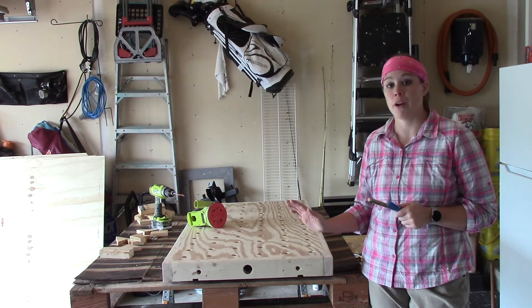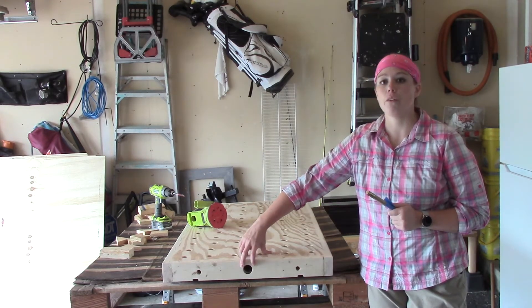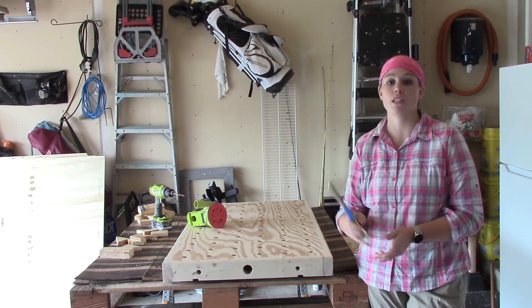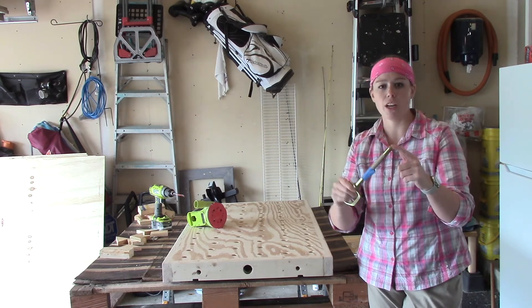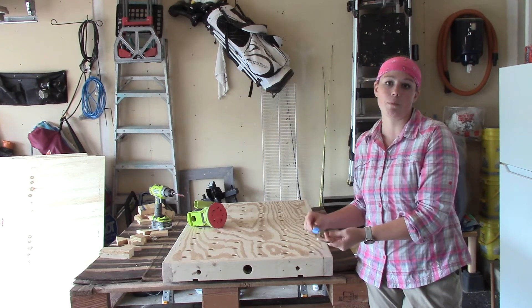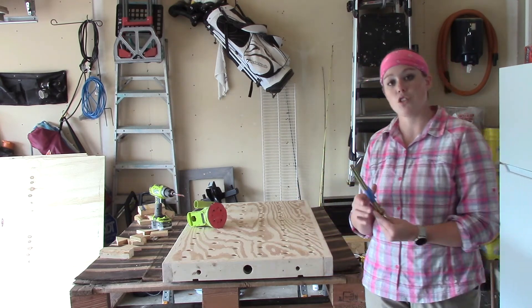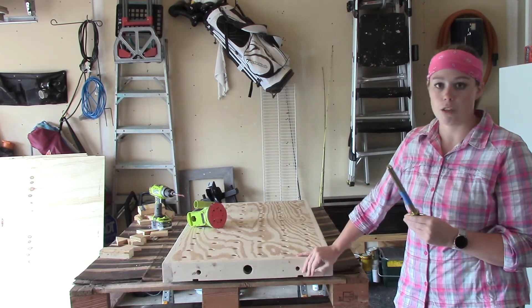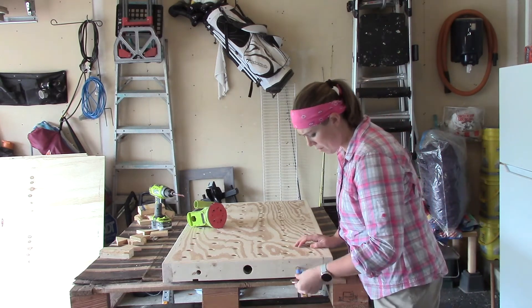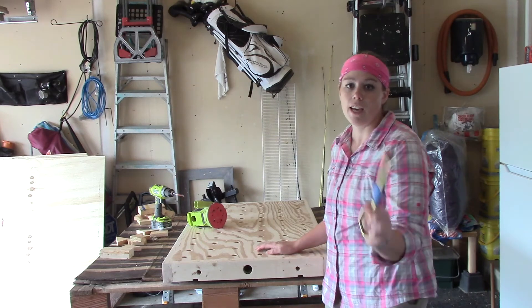Before finishing and sanding the workbench top, I wanted to drill the holes I'll be using to stabilize the workbench in its position. We have the hole already drilled for the pole which allows it to flip back and forth, but I want to use hitch pins — 5/8 inch in diameter and about 6 inches long — something strong and sturdy to hold it in position. I'm doing two of these on each side. I used a 5/8 inch drill bit and drilled as far as needed, which I measured to be about 3 and a half inches into the board, then I put a little tape on the actual hitch pin to test the hole before finishing up.